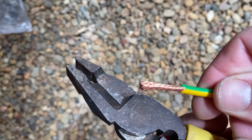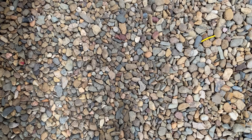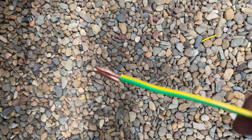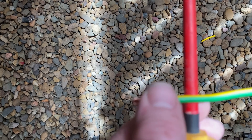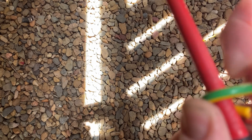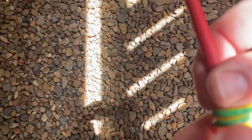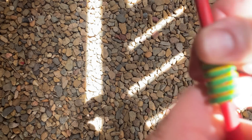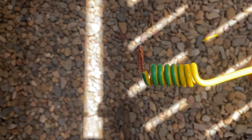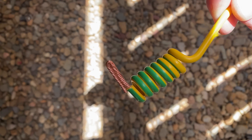So that's ready to terminate onto the bottom rail now. To relieve stress on the joint and also provide extra length if re-terminating is required, I like to create a pig's tail with the cable. I get a screwdriver and start wrapping the cable around it, about six or seven turns.